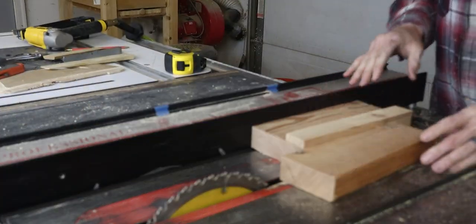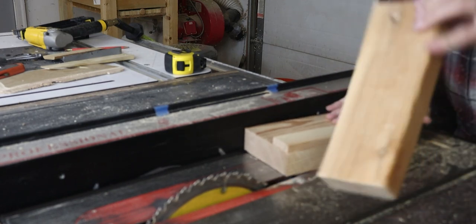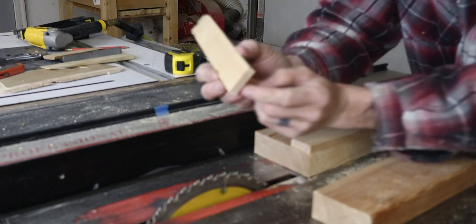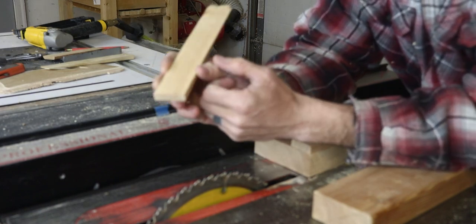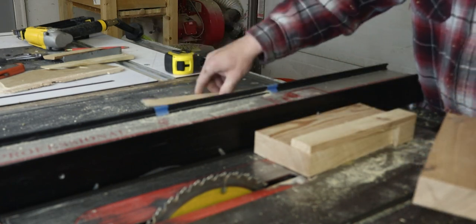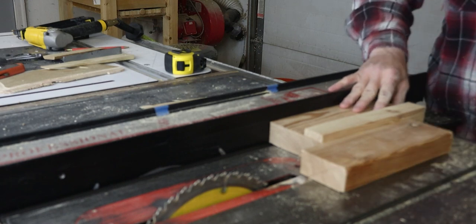It's completely up to you how you do this, but one of the things I've learned is every time you make a cut, go ahead and flip the board. That way you're working your way down the wood. The only thing that changes is your 90-degree angle — this end of your board is going to be 90 degrees to one edge and off 90 to another. If you keep working your way down the board it ends up going at more of a steep angle. So just flip your board each time.